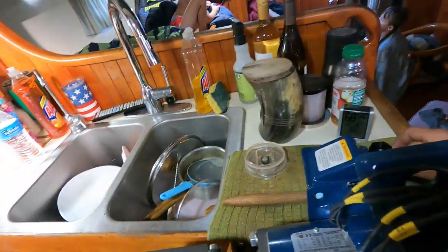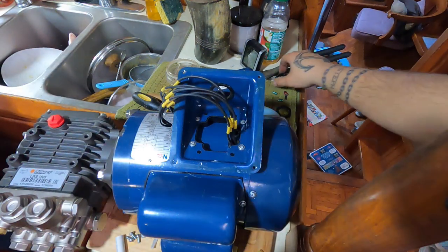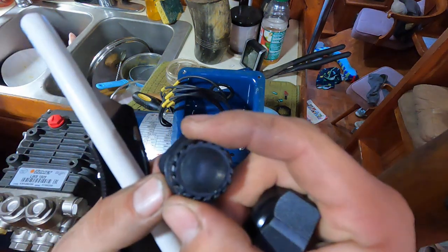It's little things you'll probably find out if you don't, but wiring doesn't just break down. It's when moisture gets into it, then it starts corroding. So if you seal everything up really good, take the extra second to do it right, this wire will last as long as the boat does. But I think people just kind of get in a hurry and don't do it well. So I'm just going to show you how I do it. This will be a sure way where moisture won't get into the connections and corrode out, because then it causes resistance and heat and all sorts of bad stuff.